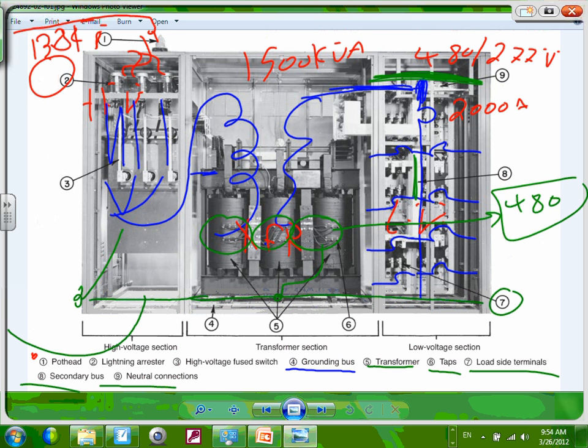We have a section with a fuse for the high voltage and a transformer. And this side was 480. One substation was 480/277. The other substation was 208/120. Very common in major buildings, but that was a 32-story building. At the 13th floor you put the substation and you come down and feed all your equipment, from the 13th floor down, 13, 12, 11, and so forth. You go feed down almost 5, 6 floors out of this substation.